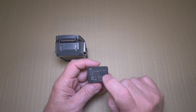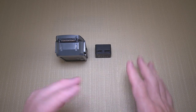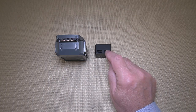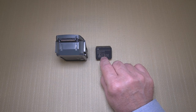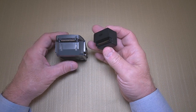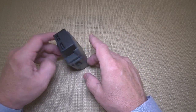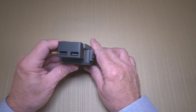When I flipped this over, my first clue that they did a great job is the fact that the output is 5 volts with 2 amps per connection. There's a cheap way to convert DC to DC — which will typically give you only 1 amp — and there's a better way that uses a switching regulator. The minute I saw 5 volts at 2 amps on both connections, I knew the engineers didn't take the cheapskate path. I also like the fact that it's a locking connector that's not going to drop off easily, and it's a sleek design I can slide in my pocket while charging devices.